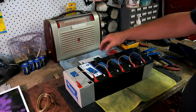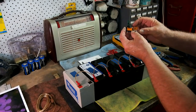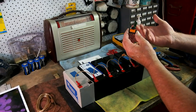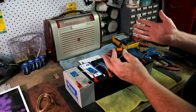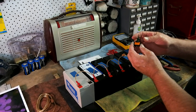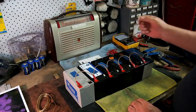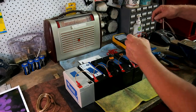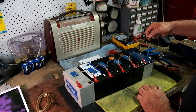With the output lead I want to put in a fuse and a switch, which is really easy to do. I want to be able to isolate it if I need to turn the system off — to change a battery or whatever — and it's not going to affect the solar. And of course I'll put in a fuse. In this case I'm going to put in a 5-amp fuse given I've got 42 amps worth of batteries. To jump in the fuse is very easy — I'll cut my wire at this point here.